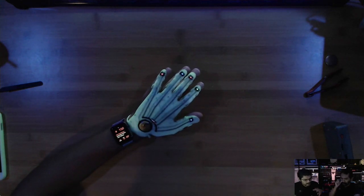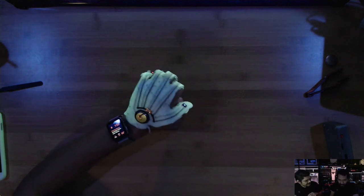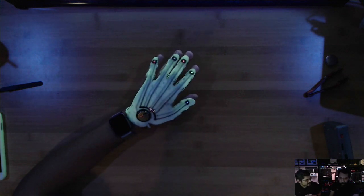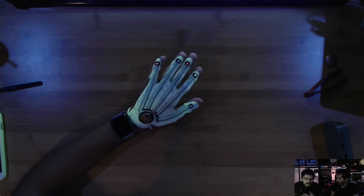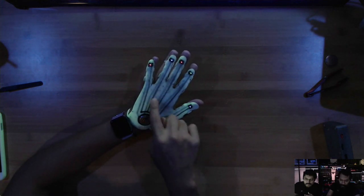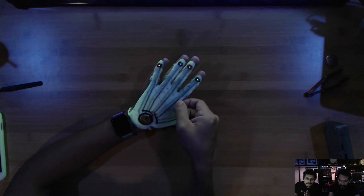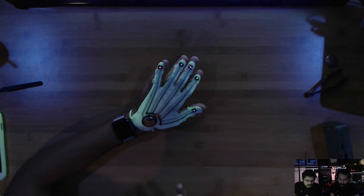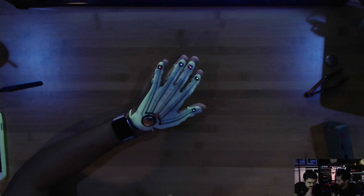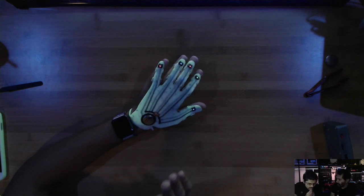Yeah, it's rubbery. It's stretchy. So it kind of insulates it and sort of protects it, as the NinjaFlex does. When we're generating our tool path, we'll take a look at that in a little bit. Yes, it is all insulated. This is 1.5 millimeters thick, but the traces are sort of on top of each other, and because we can take advantage of 3D printing, we can print on multiple layers.